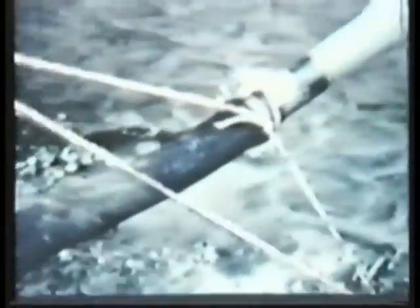They hoisted the pump on a wooden pallet to the top of a bridge span. At 29 feet and 6 inches, the pump slowed down, but it continued to pump. Today, no centrifugal pump handling solids even approaches the suction lift capabilities of the Wemco torque flow. Many hydraulic experts said it wouldn't work, but it does.